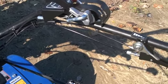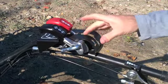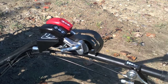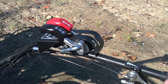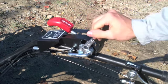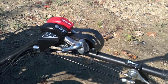The other lever is to lock in or engage your differential lock. With it disengaged, the wheels turn independently, which makes it a lot easier to spin the machine — you can turn it while walking or driving because each wheel is spinning independently and only one wheel is getting power. But if you're starting to slip, if one wheel is slipping or you're getting in some muck, you can engage the differential lock, which gives you positive traction — it locks the wheels so both are turning at the same time no matter what. Most of the time you leave that disengaged for general driving and tilling until one wheel starts to slip.